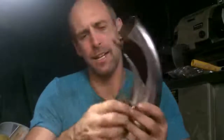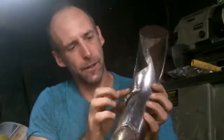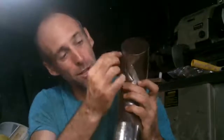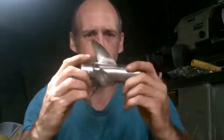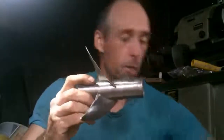I took the blades off and pulled out a piece of curvy pipe I've been saving, because for propeller blades it's kind of nice to have a curve one way but then the opposite way - like a saddle curve - and the inside curve of a pipe does exactly that. I laid this on here, figured out where it matched closest, drew my blade a little bit longer at the same width, cut it out, and then I got three blades that I didn't have to curve manually. Because I didn't curve them, the curve is really even with no dents.